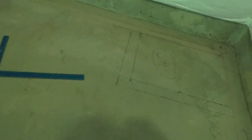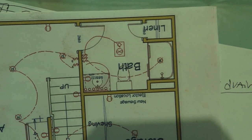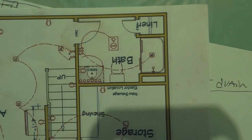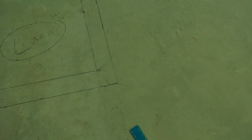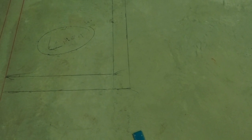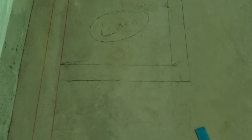What I'm doing right now is laying out the bathroom because these are interior walls. There's our bathroom — I've got to lay out a linen closet, two wing walls for a four-foot shower, and then build the back bathroom wall itself. You can see I've written 'linen' in a circle on the floor with the linen closet walls laid out. The door's going to be right here and there's the depth of the shower — the shower wall is 36 inches out from the exterior wall because the shower is 34 inches, recessed back behind the linen closet about two inches.